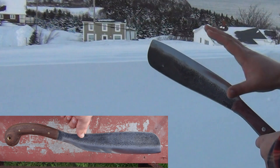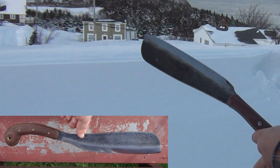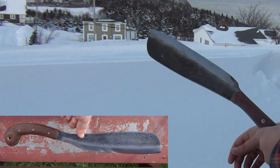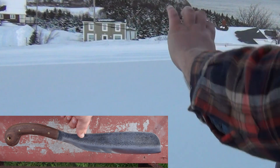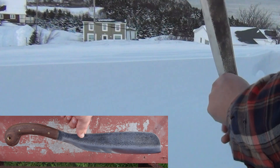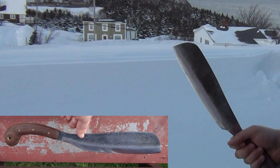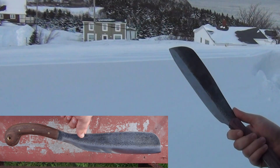This is a full, almost flat grind from here to here with just a bit of curvature. Again, this is not where you want it to be ideally — this should be a full height grind. But if I did a full height grind on this, it would remove so much weight that it would shift all the balance points back. To compensate for that I also need to fully taper the tang, but I'll do that in the future. At this point I want to do a bit more work with it to get a feel for the quality of the steel.